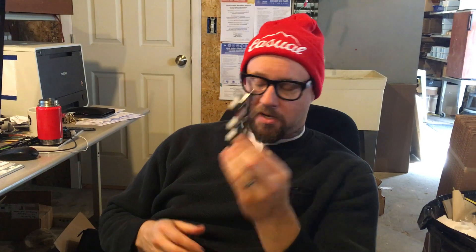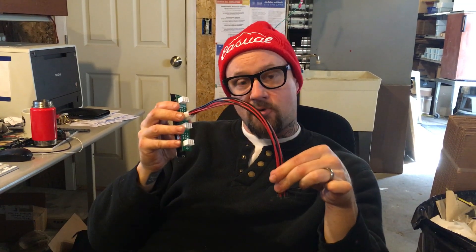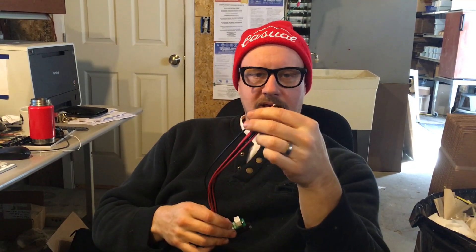This is a great fix for people who are drawing too much startup current. The TURN module is a multi-use product — you can also use it for the same kind of problem with other manufacturers' power supplies. We make Molex adapter cables with pre-tinned cables, so if you've got spade connectors on your power supply you can solder those on directly or use female spade connectors. Our power supply system comes with three ground cables — they're all common — so if your system only has one ground connection you're fine using just one cable; you can snip or tie off the others.